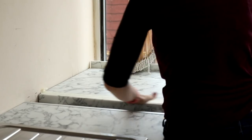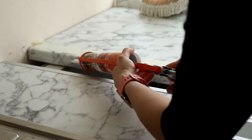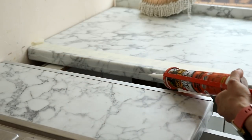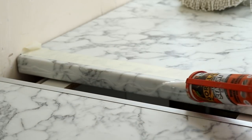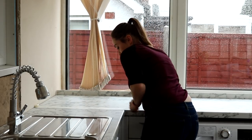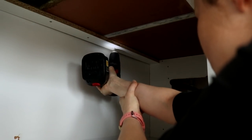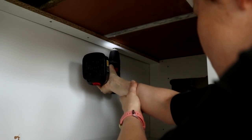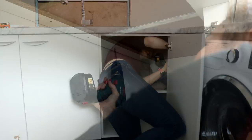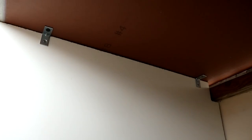The masking tape goes on again just in case I make a mess. Then I pull the unit back so it's right next to it to create a corner. For the last job, to make sure it was going to stay in place, I needed to pre-drill holes while I was inside the corner cabinet — that's where the worktops overlap — and then screw them together. I also repeated that with the end panels placed in between the worktops.